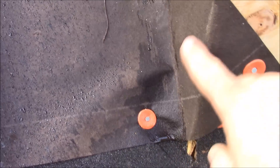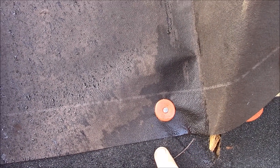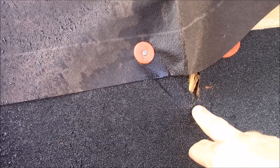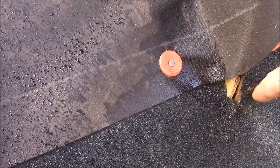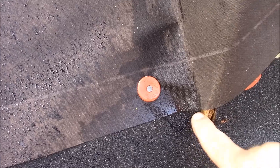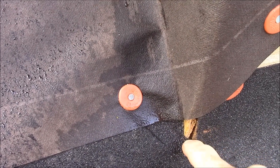You can see right here at the corner of this dormer — the felt paper comes down and there's just this little hole right here where the ice and water shield wraps around the corner of the dormer here in the front, and the felt paper overlaps it. So I don't want, if water gets behind here, I don't want it to come through this hole.